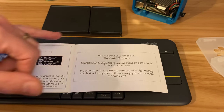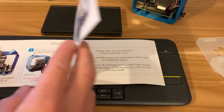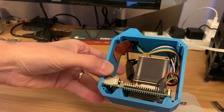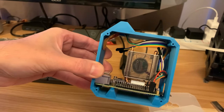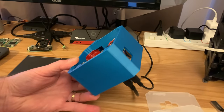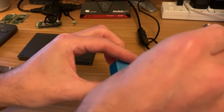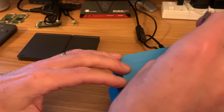It's four days later. Frustratingly, the instructions were wrong on the website — the ones in the back of the booklet. The wiring diagram is correct so I'll show you a close-up of that. I've tucked in the display at the top — I haven't used hot glue but that would be nicer. I've decided to use the Raspi Key because it's very easy to take out and put in. An SD card on the other hand is actually pretty hard — easy with tweezers but my fingers are just way too big.